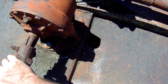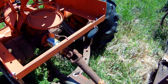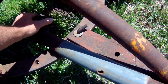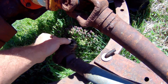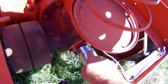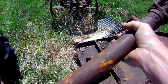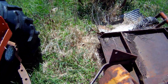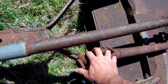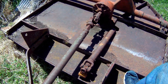The gearbox moves — you can see it down there, hopefully the camera will pick it up. It turns, but we've got one problem. The shaft that's on it is too long and it's inch and an eighth. It's an oddball, old school. We put this overrun coupler on, which we need. The shaft I've got is inch and three-eighths. They're both six-spline, but the old one's inch and an eighth and this is inch and three-eighths, which is the modern standard.